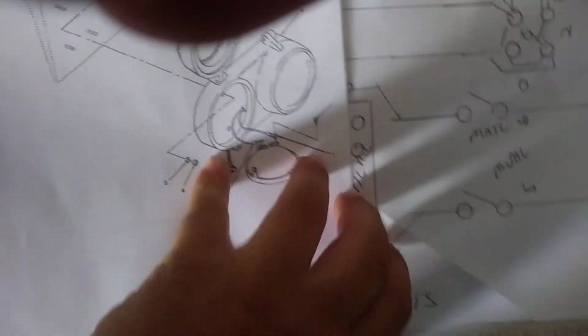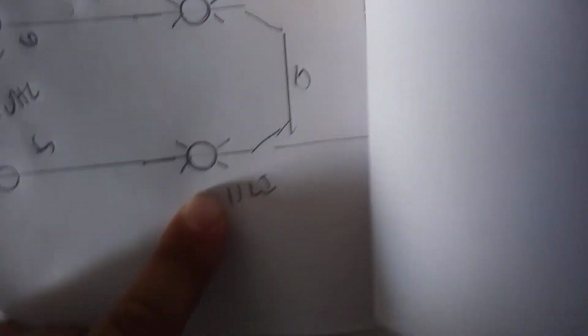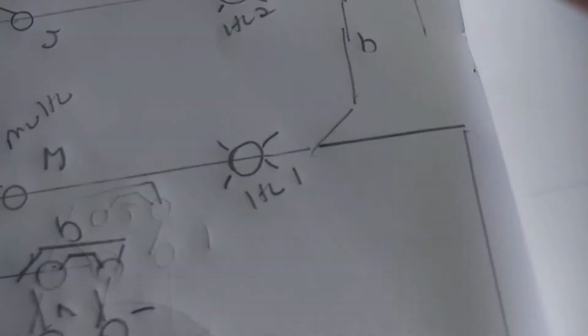All right. We went over the control over here. We have your headlights. The thing about your headlight is you've got to turn it on the other locomotive. So this is your resistor headlight. And then your resistor headlight generator field. And those show switches that are common. Over here is headlight one, headlight two, giving switches one and two in the middle, and then three and four over on the other side.